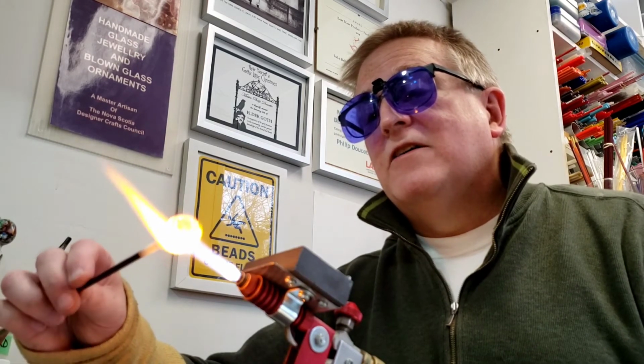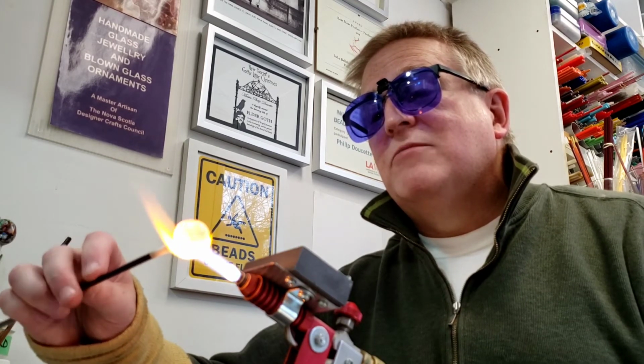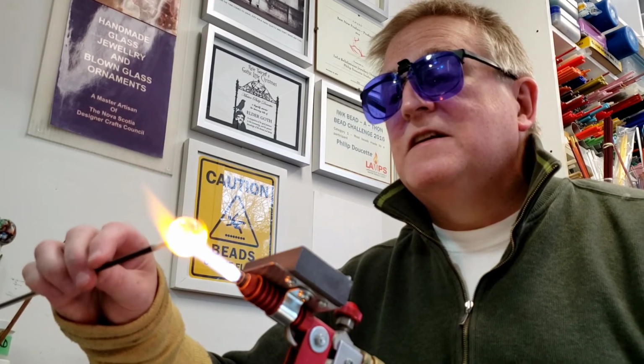Slowly rotating and heating to keep things evenly spaced. I'm holding the blow tube at a slight angle so the glass will back up and create a large, wide shape that should be at least relatively evenly distributed around the center axis of what I'm spinning.